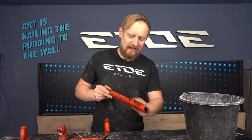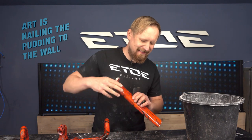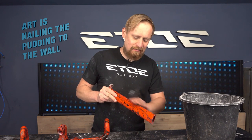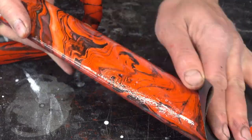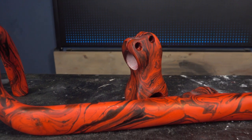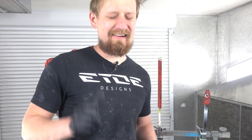I'm back from the paint booth and I'm sanding the transparent carbon primer with 800 grit. If you don't like sanding, ask your girlfriend Sandy or Sandra if they like to sand your parts. When you have a super slick surface, you can apply the clear coat for a high gloss finish and you're done. It's time to apply some clear coat — don't forget your safety gear, then have fun.